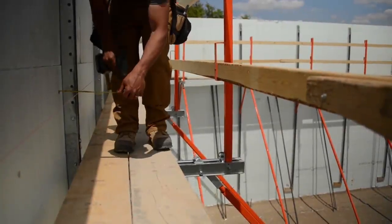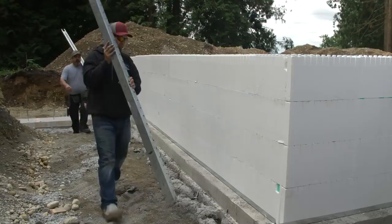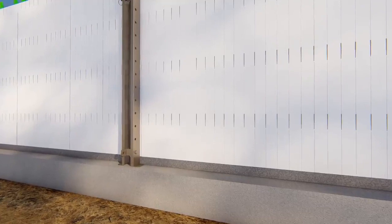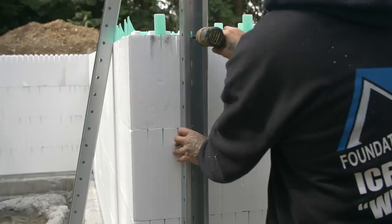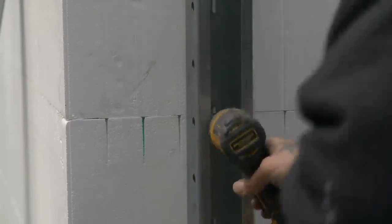Quadlock recommends the use of steel or aluminum proprietary ICF braces to ensure a safe and accurate wall installation. After the first 4 rows of panels and ties are completed, attach wood or metal strong-back braces to Quadlock tie flanges with screws. Lift each strong back about 1/4 inch off the slab or footing to allow for adjustment in wall plumb. Fasten strong backs into metal track and to every row of ties at 12 inches on center.